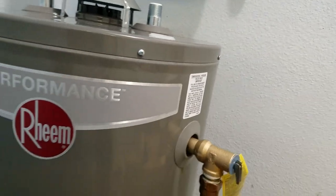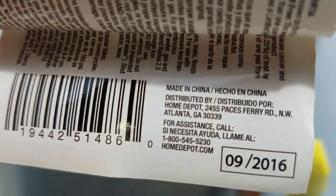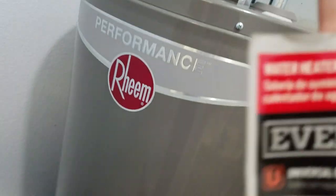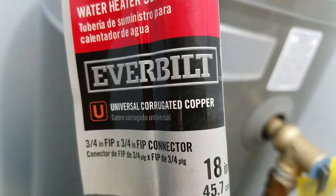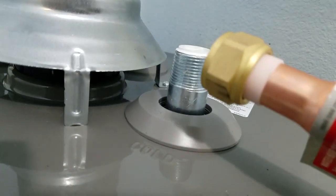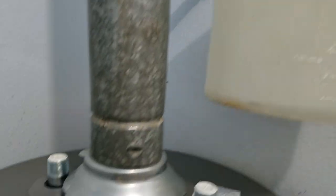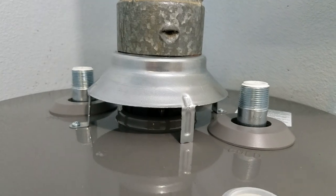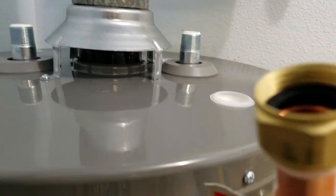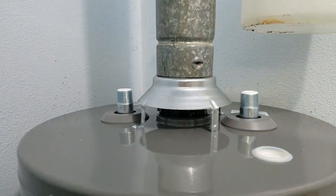I've got some of these flexible conduits — water heater supply line, universal corrugated copper, three-quarter to three-quarter. I'm going to throw some Teflon tape on there since I couldn't find any pipe dope. I'm not really sure how Teflon tape is going to work on the hot water side, but we'll see. Old redneck Bill says don't ever use that crap, but it seems fairly universal today. And these are brass — oh look at this, they have a rubber washer. I'm feeling pretty good about this. Let's get one of these installed.